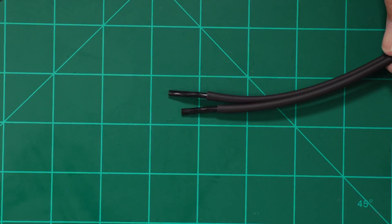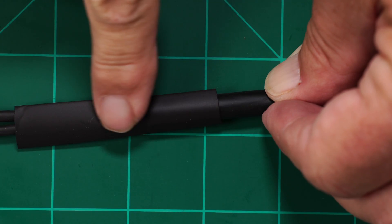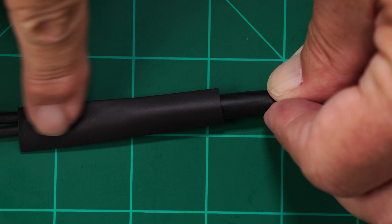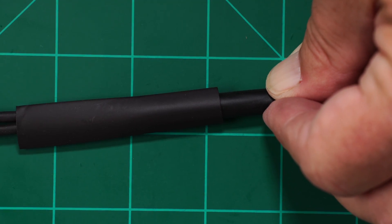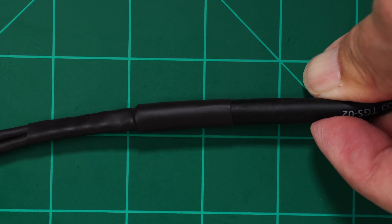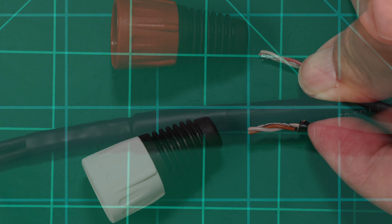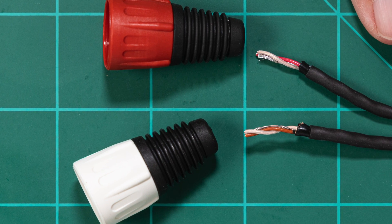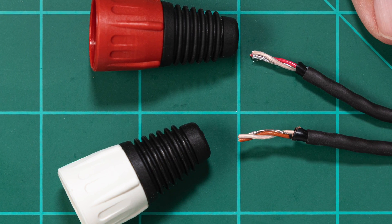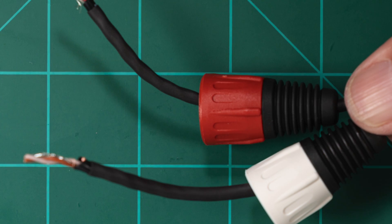Make note of which one is channel 1 and which one is channel 2. Using a hot air gun, shrink them down onto the cables. Let cool, then slide the 3-inch piece of heat shrink tubing over the entire cable and center it on the junction of the full cable sleeving and the two inner cables. Shrink that down with a hot air gun. Prep the inner two cables to the point you know which one has the brown wire — channel 1 — and which has the red wire — channel 2.